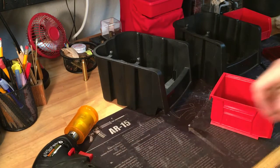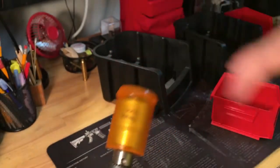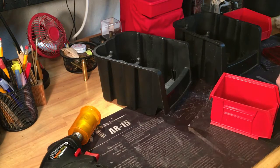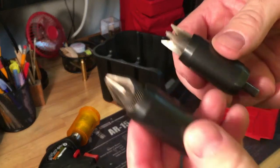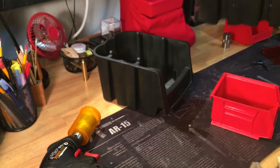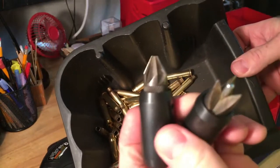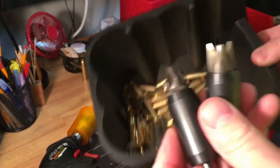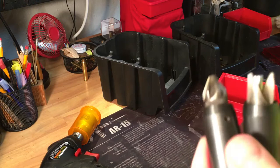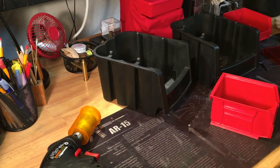Normally what I used to do was pop the WFT out, change to a smaller pill capsule, then replace the WFT in the drill with chamfer and deburr tools, and do my cutting separately. So I'm touching this brass three times: once for the WFT to trim, once to do them all with the chamfer and deburr. With 75 pieces that's not too bad, but you're tripling all your activities. So I look for creative ways to save that time.